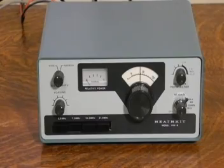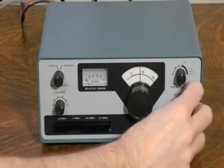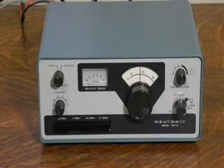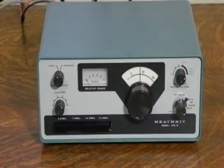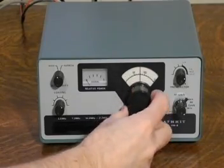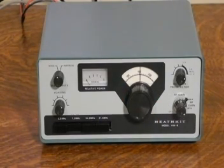Let's take a look at the front panel. Here we have power and AF gain. RF gain is on a concentric shaft. I find it's easy to inadvertently turn both gain controls at the same time. You tend to need to use the RF gain on strong signals, as there's no automatic gain control. There's a preselector control with approximate marks for each band — this needs more frequent adjustment on the lower bands, especially 80 meters. Tuning utilizes the dial with a 6-to-1 vernier. Dial indicators of 0 to 250 correspond to the first 250 kilohertz of each of the four bands. You need to add the starting frequency of the band to the dial reading: 3.5, 7, 14, or 21 megahertz.